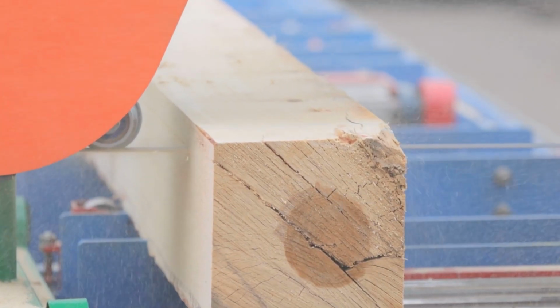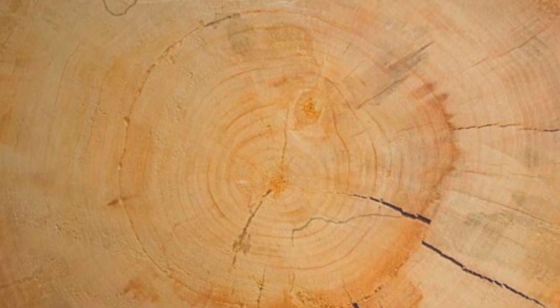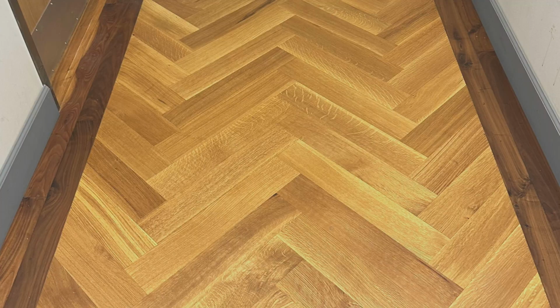White oak is just very popular right now. This way of milling lumber makes for some very desirable effects. Let's look at how it's made. The grain of a tree is circular, with each ring representing 1 year. The way the grain is facing on the piece of lumber is what determines whether it's rift-sawn, quarter-sawn, plain sawn, or live sawn. Those are the 4 common types of sawing.